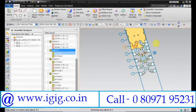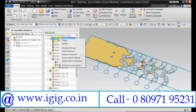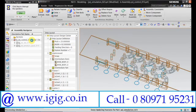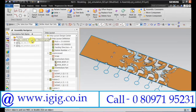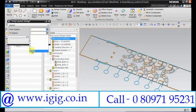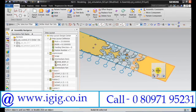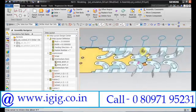Now we just need to update the piercing and we will get the final strip layout. For that go back to strip layout definition, clear the simulation, again simulate piercing from station 1 to station 2. Now we need to do blanking — remove blank material from station 3 to 7, click OK. Hide this part, and this is your final strip layout for this component.